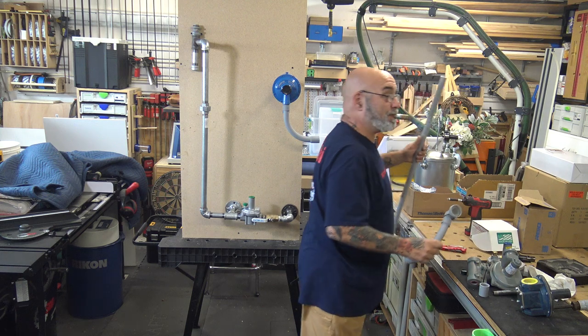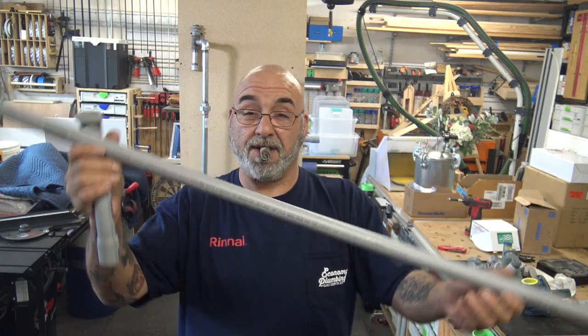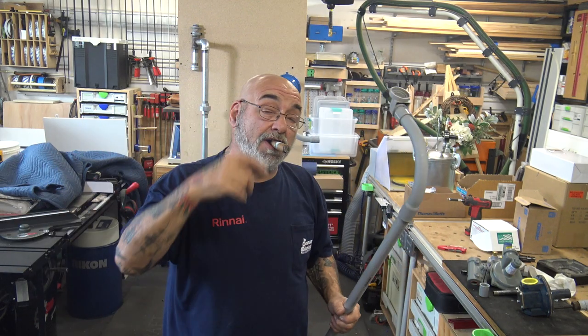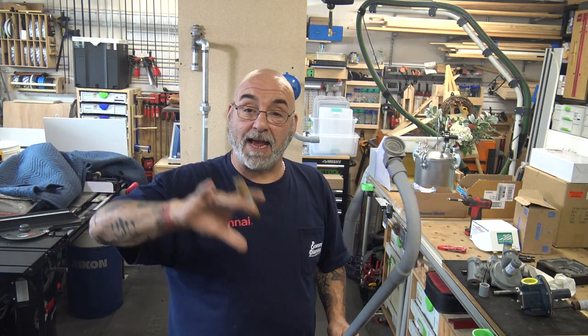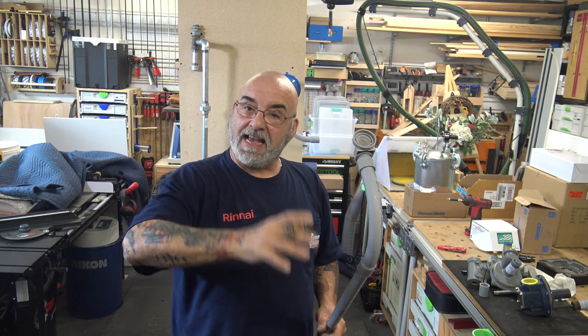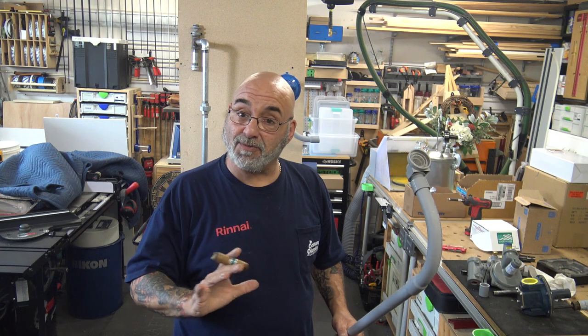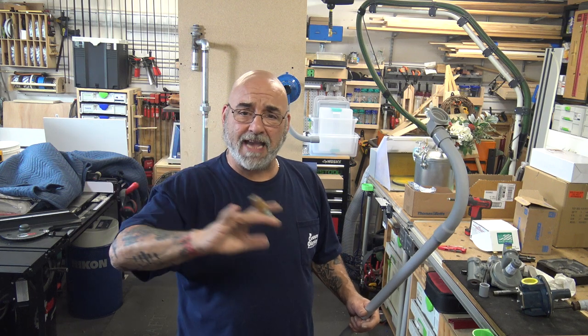And I happen to have 5 feet of gray pipe. See, it's the electrical conduit, nothing fancy. And like I said, if this is going in the ground, you could do it with PVC. It's in the ground, UV light won't affect this pipe. Anything out of the ground, it will affect it. But if you paint it, you'll be fine. And that's sometimes what we do. We keep 100 feet of this in stock. We keep a ton of elbows, male adapters, straps, you name it, we carry it.